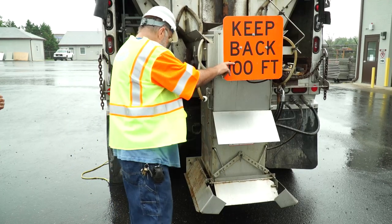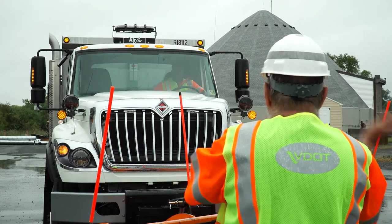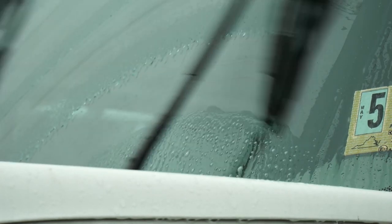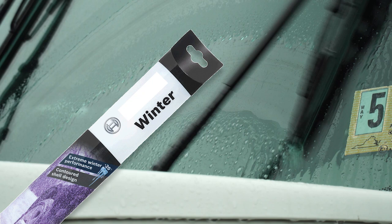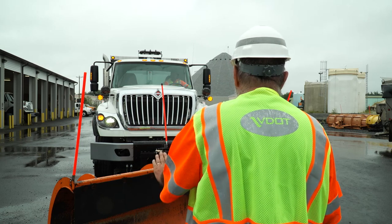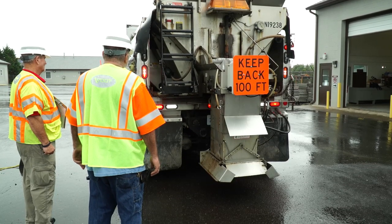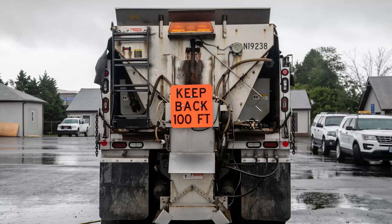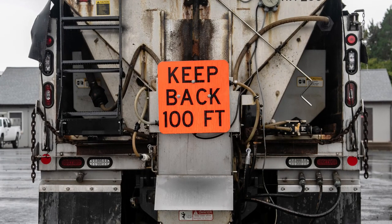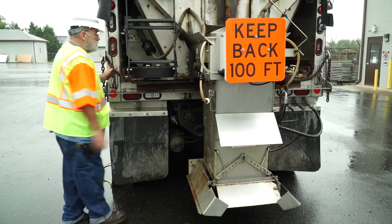The VDOT approved keep-back 100 feet sign must be installed securely and visible. The vehicle must have operational wipers and an operational window washer fluid system. Mention to the operator that VDOT strongly recommends the use of winter type wiper blades. The vehicle must have an operational horn — it can be either a city horn or an air horn. The vehicle must have an operational backup alarm. The bed of the truck must be level and free of any structural damage or corrosion that could cause the spreader to shift or come loose. It should also be free of debris, tools, or other materials that could slide out during operations.